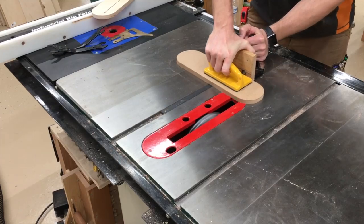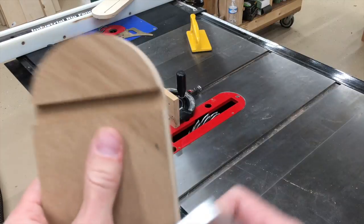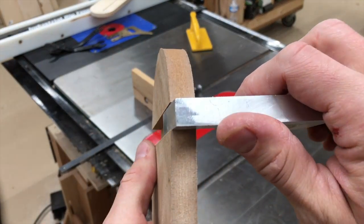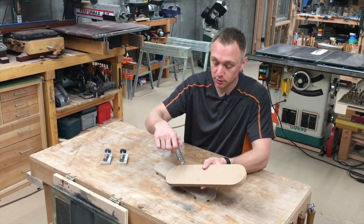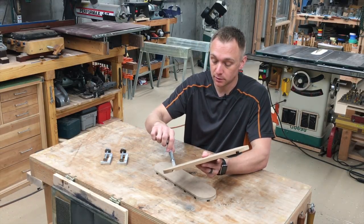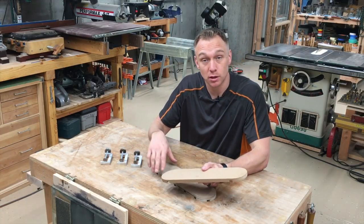It takes a little bit more time to make because you've got to set up either a router bed or dado to cut these. We're selling the clamps on their own so you can get into this fairly cheap with just the clamps and start out making your own templates if you want to go that route. This certainly works, so happy to be able to provide a budget option on this one.